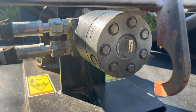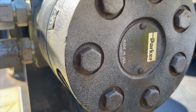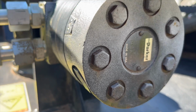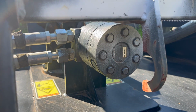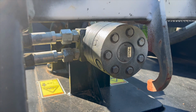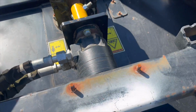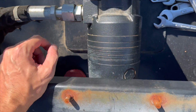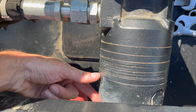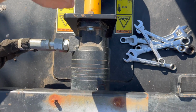But struggling with this part number, if you can see in there, this is the last 4 of the serial number: BBFC. And that means that this particular unit has an internal bidirectional relief on it, which I believe, let me drop these down here, is basically this top hat here. It's your relief for it, so that if you smack into something with the brush cutter, it has a relief.